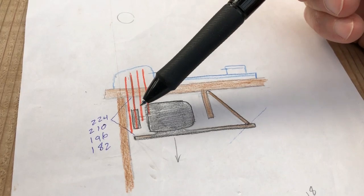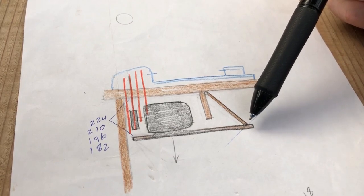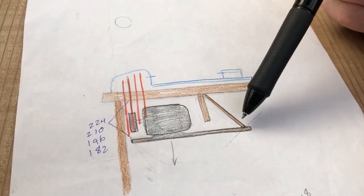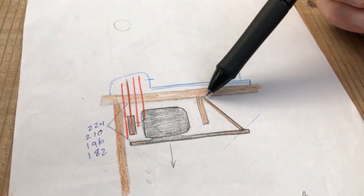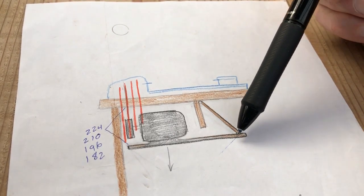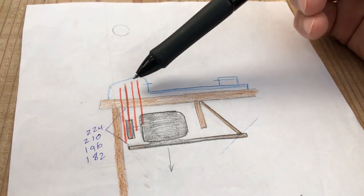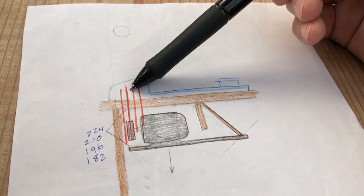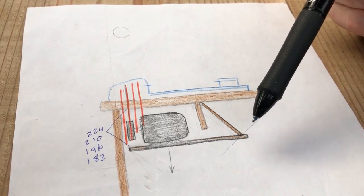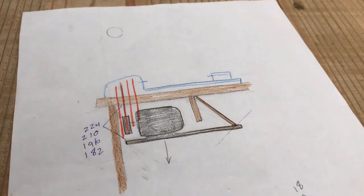The length of the belt determines it for this side, but it needs to travel at the same angle on the back side of the base too. So this is 38 degrees, and perpendicular to that is 52. From the bottom side of the bench, if this comes down at a 52 degree angle, it'll give you roughly — obviously it's not going to move in a straight line, but it's pretty close. Especially if you measure the base from the midpoint of the belts to the back. That kind of math isn't going to get you to Mars, but it's good enough for mounting a benchtop lathe, I think.